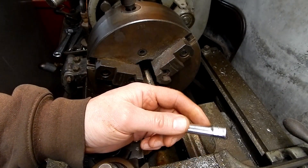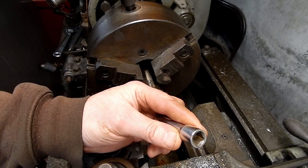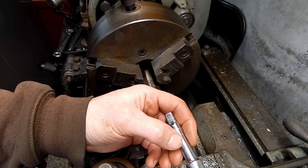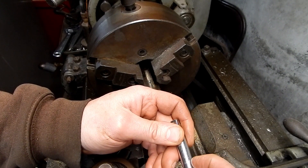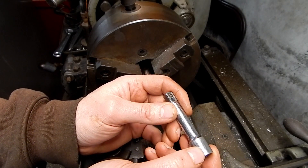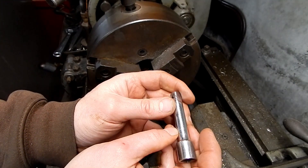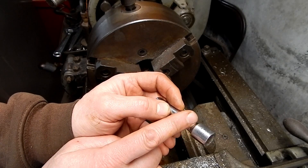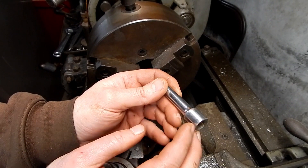What I'm going to try and do is make one of those with the help of an old, cheapo, 3/8 extension. My plan is to see whether I can get this part off and then turn this chromed area off of here, and see if we can't get a rough enough surface so the drill grabs it easily. If that doesn't work, I could use my spin indexer over in the milling machine and put some flats on it so the 3-jaws of the drill chuck can grab it better.